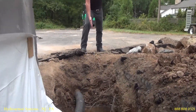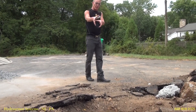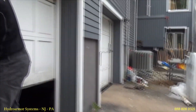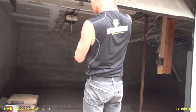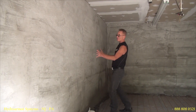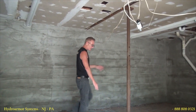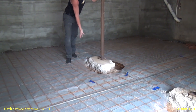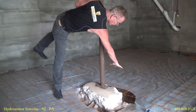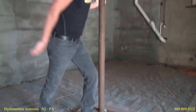There you can see the piping coming out — this is going to be connected to the system on the inside. I'm going to be running four-inch PVC from here on out. Inside, this is the rough casting we put on — this is actually the first coat. You put the first coat into the wire and let it cure, then put the second coat over. We left more of an opening here at the footer area because we're going to fill this with concrete to serve as a footer to hold up the garage.